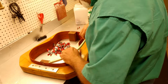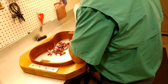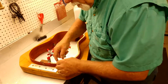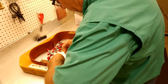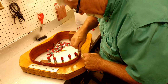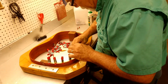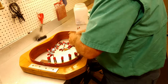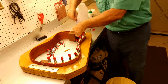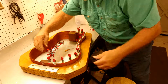Now, I usually spread it on the back side of the kerfed liner, and then I begin feeding it from the butt block to the neck block. As I'm going, I'm keeping it under tension, and then I'm putting on a clamp. I usually set the clamp with 4 teeth showing and then a clamp, 4 teeth showing and then a clamp, all the way around, and that gives a pretty even squeeze on the material so that the glue can settle into place.